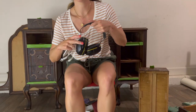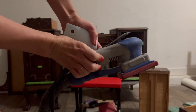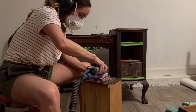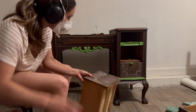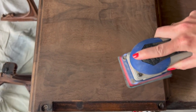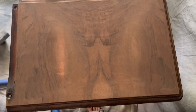Now I'll be moving on to sanding. I always wear an N95 mask or higher and ear protection — these headphones double as Bluetooth headphones, which I really love. Using my Surf Prep 3x4 Electric Ray, I'm just scuff sanding. The goal of scuff sanding is to give it some tooth for better adhesion, not necessarily to sand down to the raw wood. For scuff sanding I typically use 220 grit. Originally my client and I had talked about keeping the top natural, but it was veneer, which can be kind of finicky when sanding and restaining.